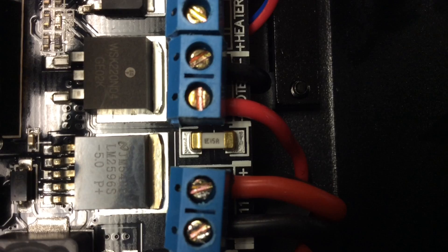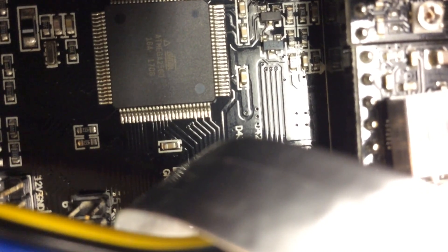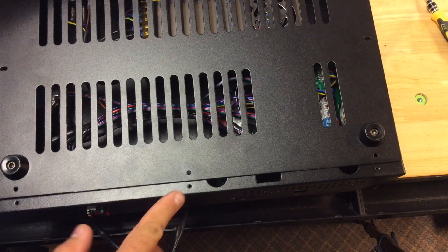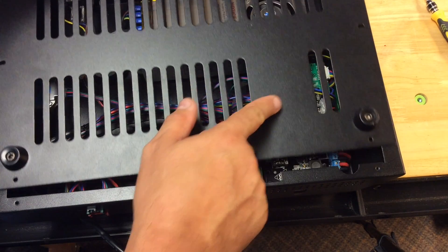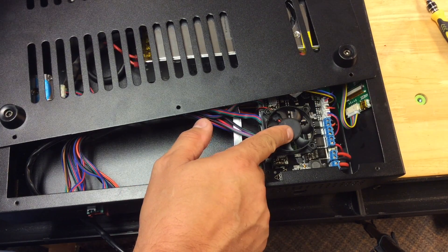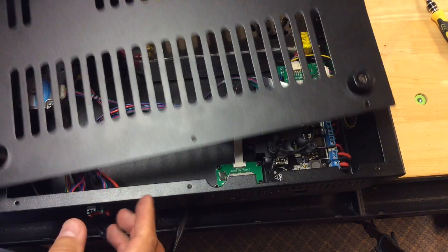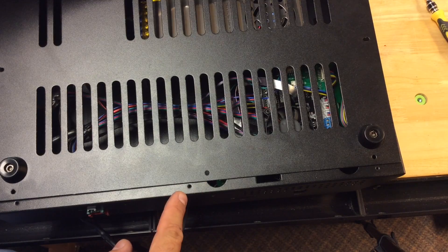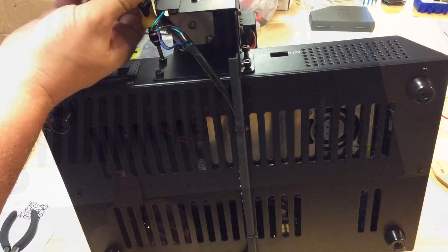There's another 15 amp fuse you have to solder right next to the FETs over by the hot end wiring. So it does have safety in it, it's just not easy to replace. It does have an ATmega 2560 so it's an 8-bit board and it's probably running Marlin. The base is interesting — when I lined it up, the fan appears to be blocked by a solid piece. I flipped the base around but the holes didn't line up, so I had it right the first time. I guess the plan is just to block that fan from stuff flying into it.